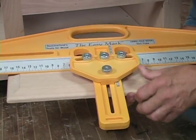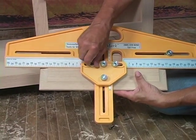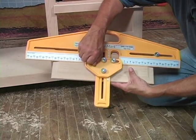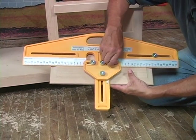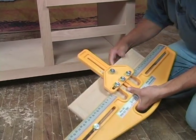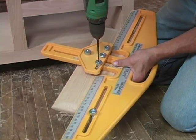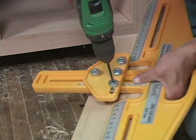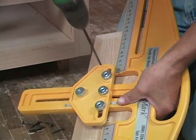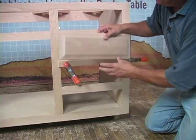Snug that down. Now we have some bushings we're going to drill through. If you've got one knob, you drill this one, and for handles you go here. You can adjust these to whatever width handles you want. Once you've got that locked into position, you're ready to drill the holes for your hardware — drilled very accurately with this jig. It comes with a six-inch aircraft drill. We've got the holes drilled, they're perfectly placed, and we're ready to install.